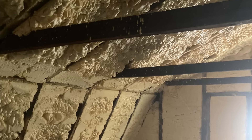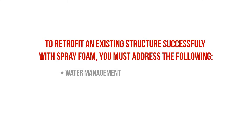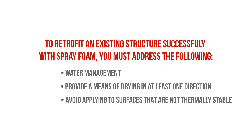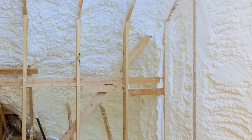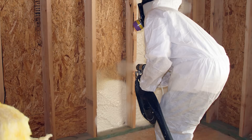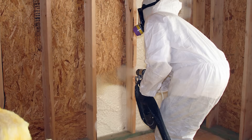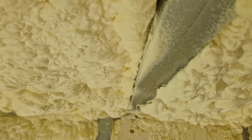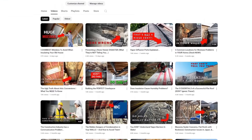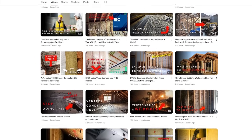There certainly are uses and applications for spray foam, but you have to address bulk water management, you have to allow things to dry out if they get wet so that we aren't trapping moisture in the spray foam, and we have to make sure the spray foam is thermally stable. There are also other issues on the manufacturing and application side. Imperfect application is a very common reality, especially with so many variables involved in mixing the A and B components on site at the right application temperatures and with the right substrate preparation. A lot can go wrong with spray foam, which is why we tend to avoid it in most cases nowadays. We have other videos on our channel discussing options to successfully insulate and air seal without the use of spray foam.